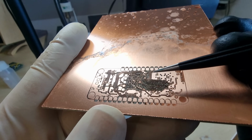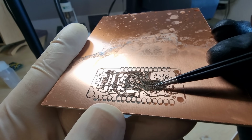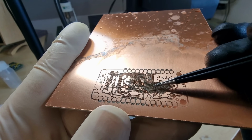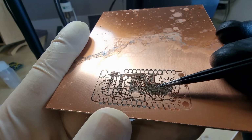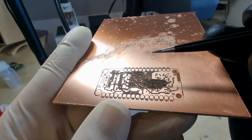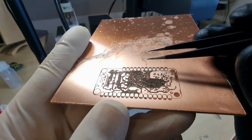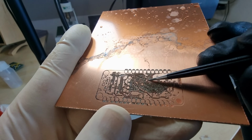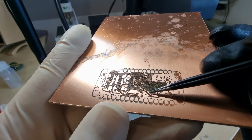One more concern would be that overheated substrate will carbonize, and therefore have a lower resistance and allow for more leakage currents. But still, this would have been a dream for me a few years ago. Nowadays I don't think I'm going to use it that much, because Chinese circuit board manufacturers are just so cheap and fast and good. Let's hope it stays that way.